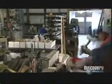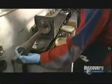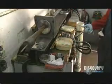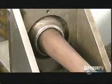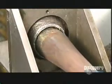To round it out, he shoves it onto a bell-shaped rod and hammers it back into shape. Then he irons out the hammer marks with rollers. The bell stem, fitting loosely on a steel mandrel, goes through a draw bench. A hydraulic cylinder pushes it through a thick lead washer, pressing it tightly around the mandrel to its shape.